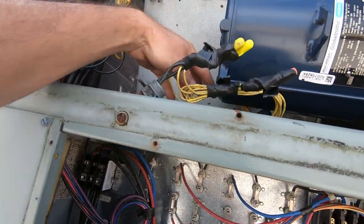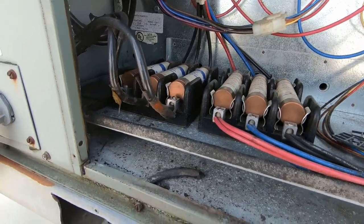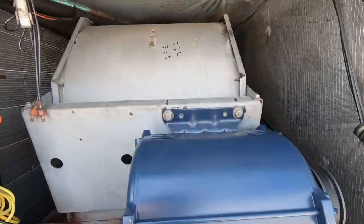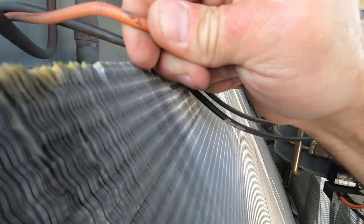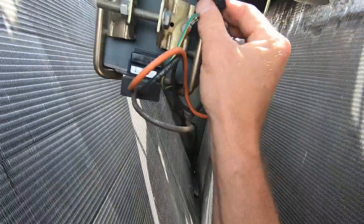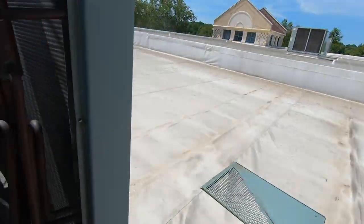The blower - I have an issue with the wiring on that, just the way it's run. I forgot a pen and paper to start writing things down, so I'll be taking a trip back down to the van to replace those fuses - I'll grab some paper and a pen then. I've got some wires here that are getting scuffed. The zip tie is not secured very well - they're not rubbed through completely but damn close right there. We're going to have to address these wires and get that other panel off. They're going to be getting written up for a coil cleaning as well.